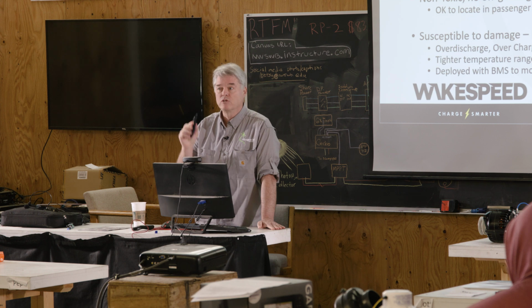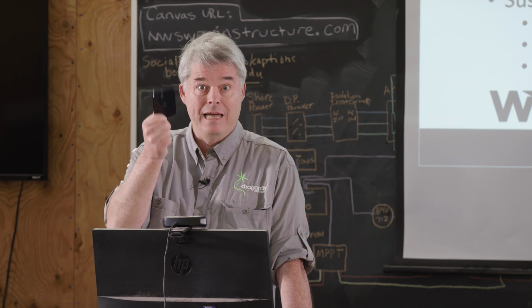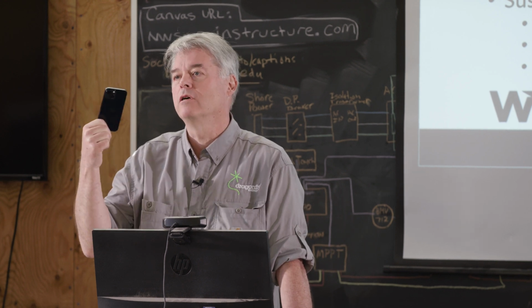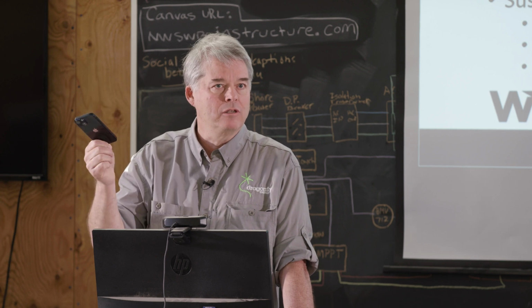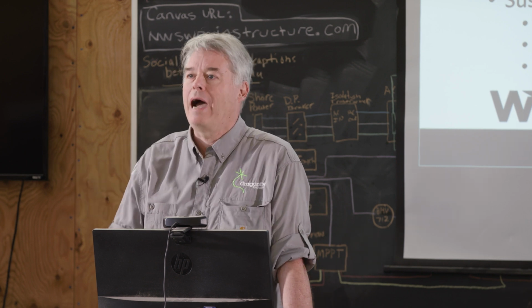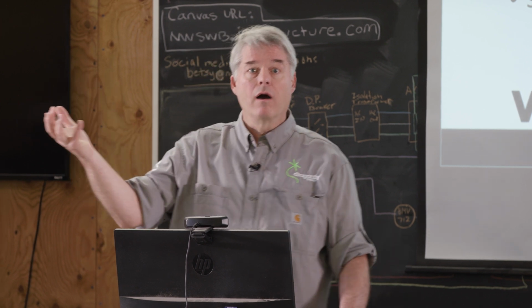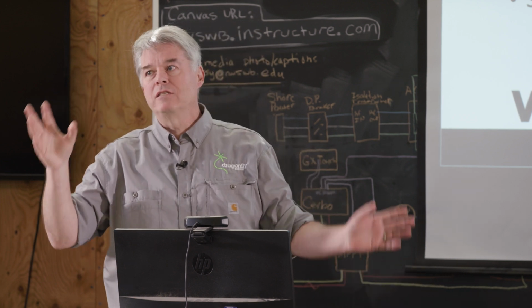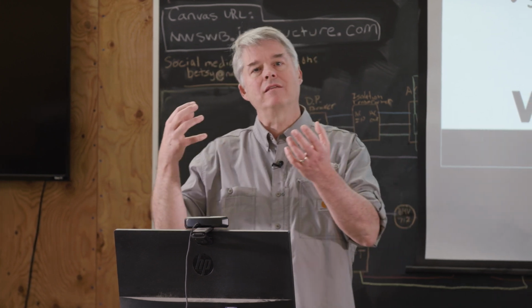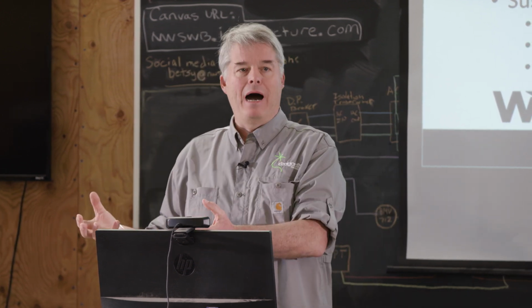I am belaboring this because there is a ton of confusion in the consumer's mind about the dangers associated with lithium batteries. And yes, you have to be very careful with the ones used in here, with chemistries, the NMCs, the ones that have cobalt, the ones that have the benefit of higher energy density. But the trade-off is they're not quite as safe. And if you are using a battery pack with one of those things, you have to take extra precautions. For example, never mount them in the living compartment. That's not a bad chemistry. I don't want you to walk away with that. It's not a bad chemistry, it's just a trade-off. And if that's something you value, that higher energy density, you have to take the steps necessary to have a safe system. Those type of batteries are mounted outside the vehicle in a metal box.